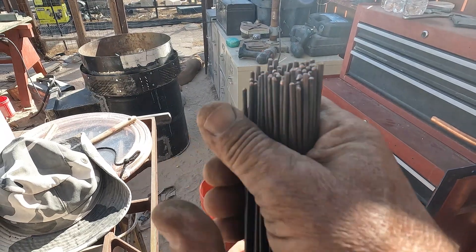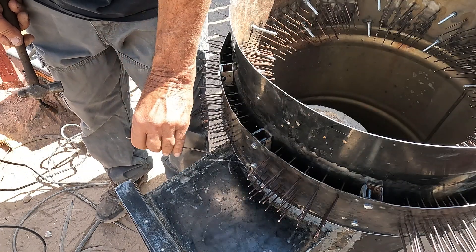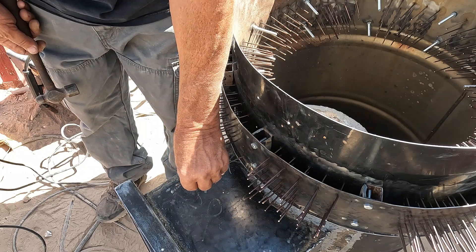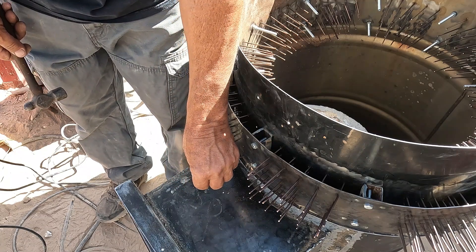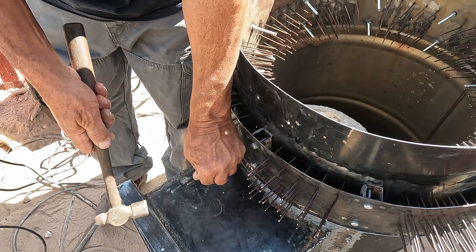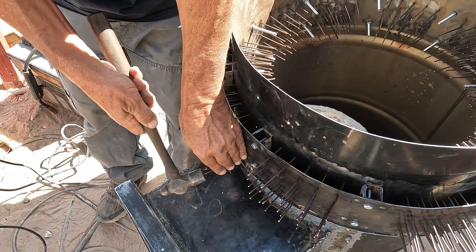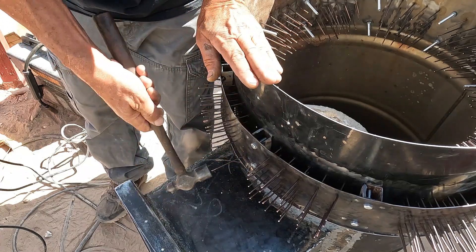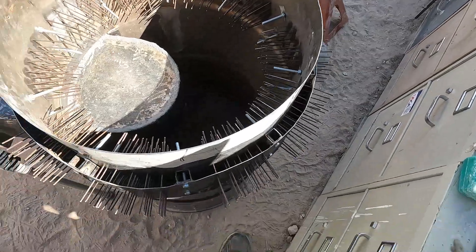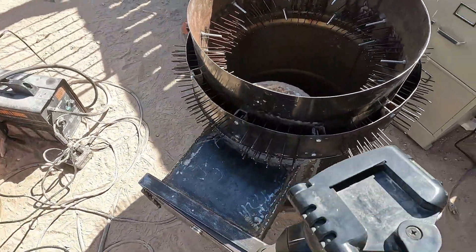There's a hundred pieces all straightened out — the last five pieces. What I did is I opened the hole up a little bit on the outside so it slips through, and then the inside hole is tight, a couple thousandths under. That gives me 250 heat transfer rods — copper-plated steel rods.